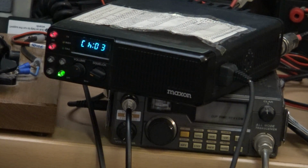Right, so when we did the PMR 446 demonstration the other week with the Midland GB1, which is the only legal half-watt PMR 446 mobile I'm aware of with its tethered antenna, on the second test we managed to get Scratchy Corner, although it was only a one-way conversation. So that's half a watt on a tethered aerial with, you don't know what kind of cable, because I don't know what kind of cable, and the magnetic aerial provided. Now those PMR 446 systems aren't there for long range, they're there for on-site services with walkie-talkies and things, so it does what it says on the tin. But we were just doing that for our own curiosity. I knew other people would be interested too.